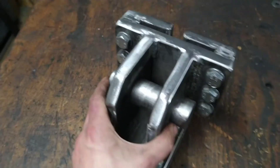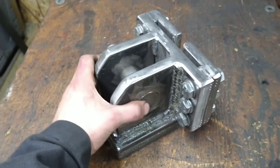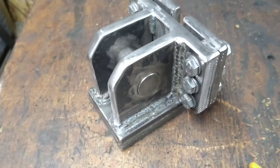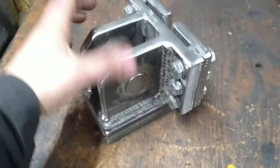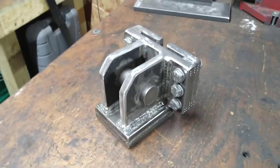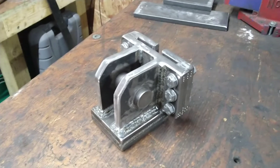Once it's in I'll probably trim this bolt down to size, and drill and tap either side, just having a washer and a bolt either side to hold it in place. The force is only downwards — there's nothing really side to side. I'm going to start putting the base together now and then fully weld the frame up, so it's not far off finished.